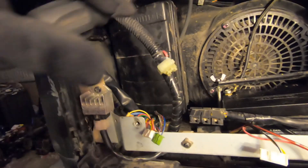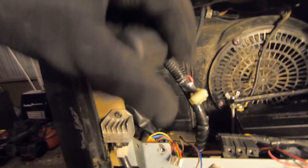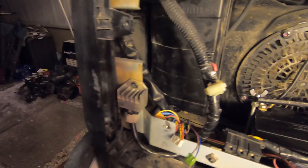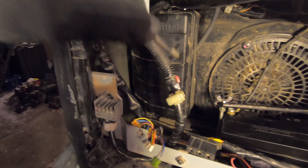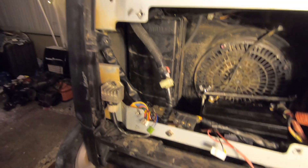Now that we have the inverter board out of the way, I need to pull the air filter lid or maybe the whole box off. There's a screw on the top and the bottom which usually isn't a problem, but there's no direct way to access them. I'll save you the pain — I'm going to hit a time lapse.